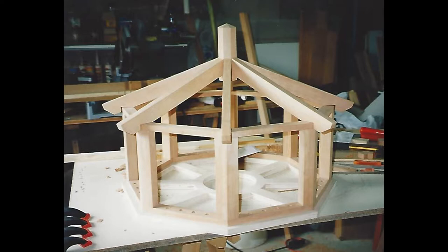And the post above, all those rafters are mortised and tenoned into that post above, and on the plate they are cut tight to the plate and to the configuration of the post, which has the angle for the 8-sided configuration. As you can see, left to right, the rafters are cut pretty snug to the plate. There are no really huge gaps. If I took a picture up underneath, you could see better how it's cut like a V into the conformity of the angle.